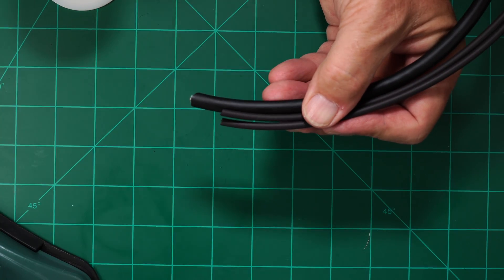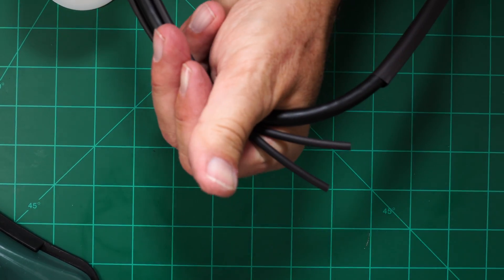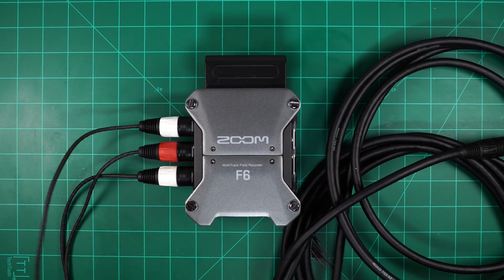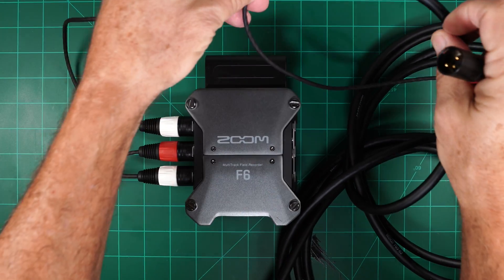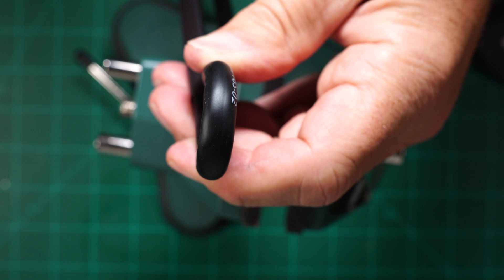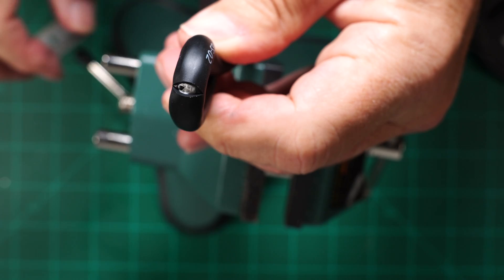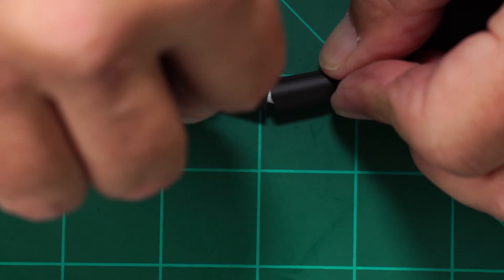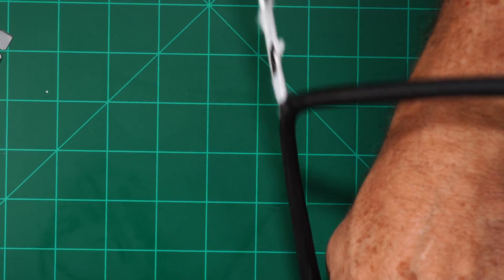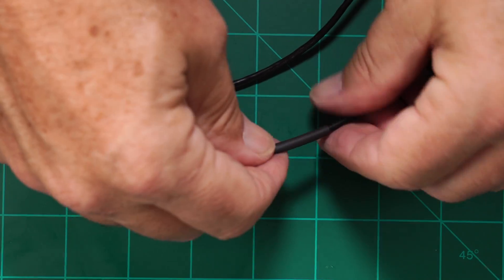Prep the two 3-pin XLR cable ends. Start by measuring about 15 to 16 inches back based on the amount of thin heat shrink tubing you have. The length depends on how close the XLRs need to be while plugging into a recorder or audio interface — I leave enough so they can easily reach both sides of a Zoom F6 recorder. When you have the distance marked, carefully use a single-edge razor blade and slit the outer cable covering without cutting through the two inner cables. Slice along the outer sleeving enough to split it by pulling the outer sleeve along the cable. Slide the two 1/8-inch pieces of heat shrink tubing on the two inner cables.